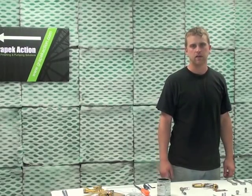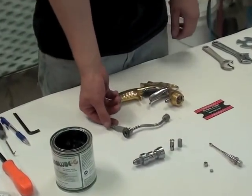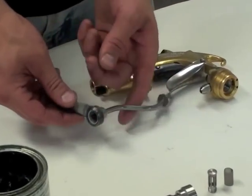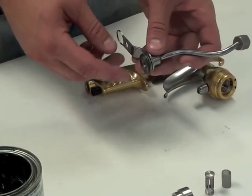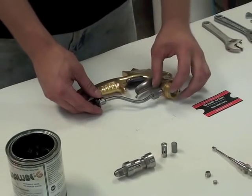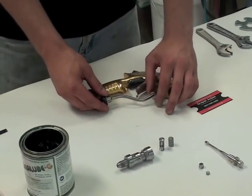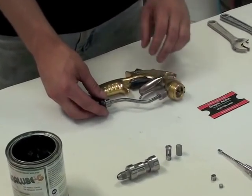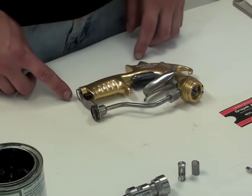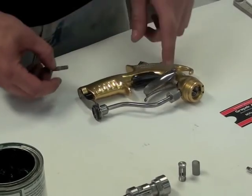The next step is installing the fluid tube. The first step in attaching the fluid tube is to make sure that the white o-ring is in the bottom of your fluid tube. That connects to your fluid swivel and gives you a nice seal. Begin by starting the threads here, but don't tighten them down the whole way. It's easier to put in your air inlet and your bottom screw before tightening that down.